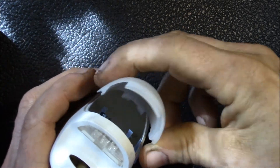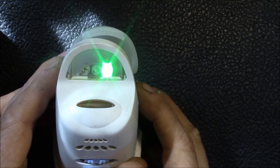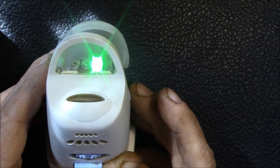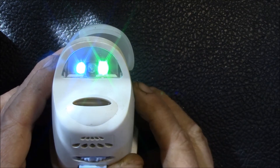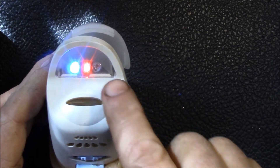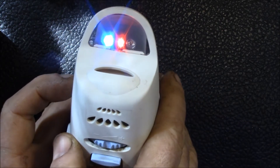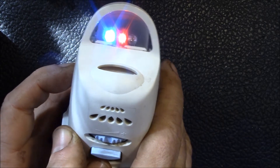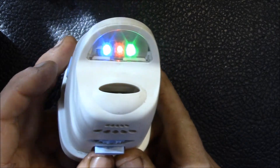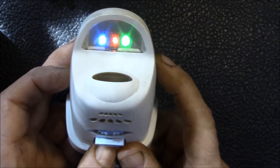As soon as this is plugged in, it's actually running. The switches only control the LEDs. This is the mode I showed and emulated with my Arduino sketch. If you click the button a second time, you get the same fading RGB LEDs, except this time it's slower — same pattern, just goes slower. The third button press freezes the LEDs on whatever color the fading pattern was in. At that point, you can step through three intensity levels of that particular color. The fourth button press turns all three LEDs on, and again you have three steps of that fully-on color. The fifth press is off.